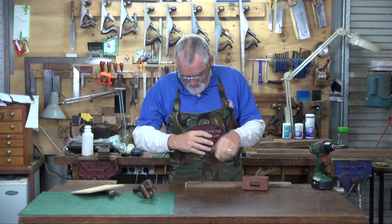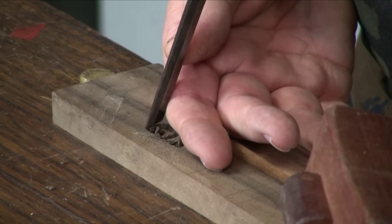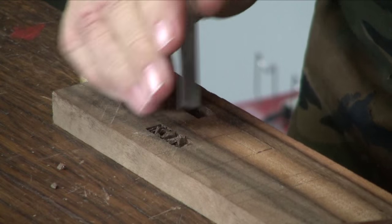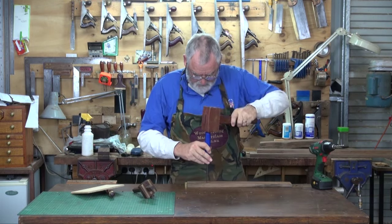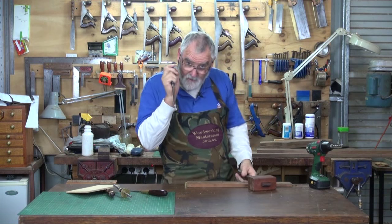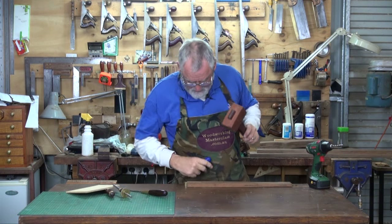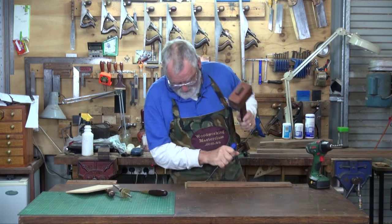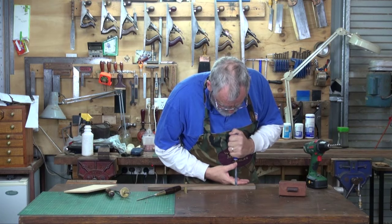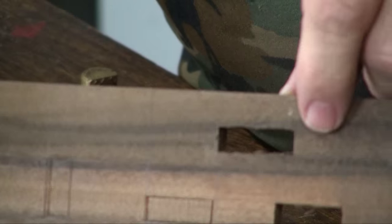When you come up to the end, move the back of the chisel about half a millimetre from the end line, give it a tap, then put it right into the knife mark and hold it perpendicular — give it a chop down. Same at the other end. Turn it over. Even while doing this, with those holes there, the chisel just wants to go into empty space, which means you lose control. This one needs a bit of cleaning up on the side walls, but we get there eventually.